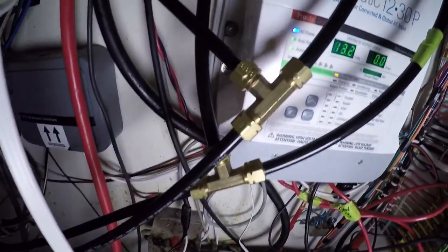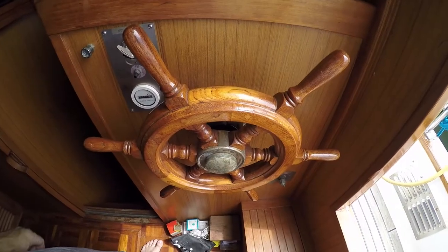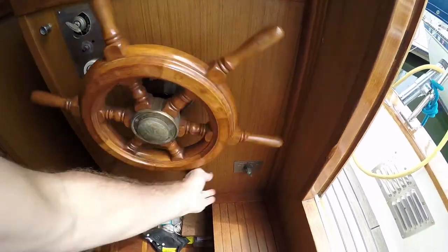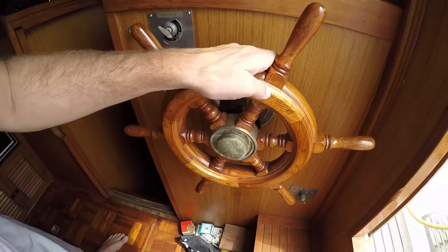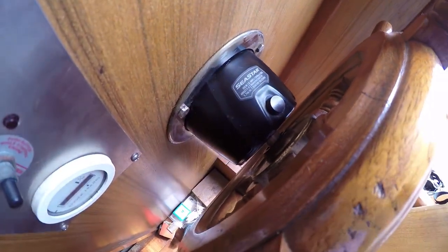Here's the autopilot pump and the T-fittings to tee off to the wheel pump as well as the autopilot. Most of the fittings were tight and leak-free; I had a couple of tee fittings that were leaking a little bit of fluid, and I ended up purchasing some hydraulic thread sealant to solve the leaking. Here you can see the front side, and here the check valves clicking when you change direction — the checks are louder than the old pump. It's about six and a quarter turns lock to lock. The reason I maintained the old cap and mounting bracket was because of the varnish finish on the veneer; the new brackets were a little bit smaller in diameter, so they exposed some unfinished wood, so I just made it work with the old one.